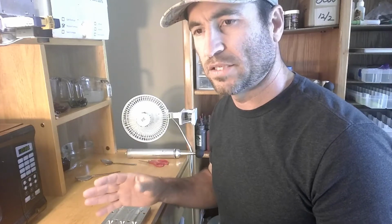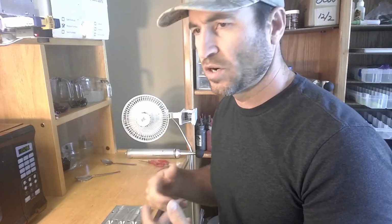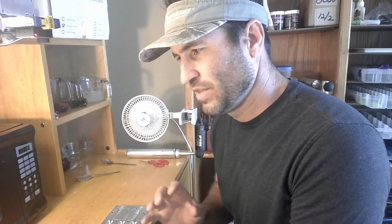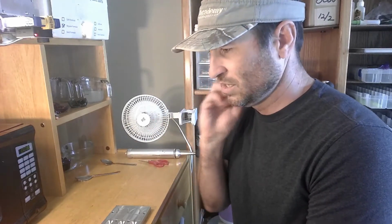Little tip, don't heat it up too fast. Do it 30 seconds at a time, check it, stir it, whatever you have to do, because if you heat it up too fast, especially with light colors, like the smoke is just one drop of black in there, and the pearls, I've found that they tend to yellow a whole lot faster than the other types of colors.